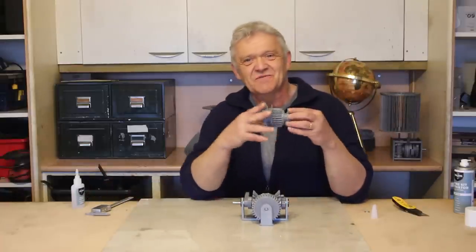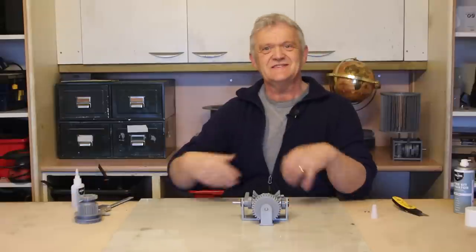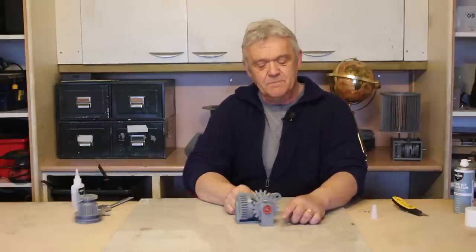The ratchets are a little bit delicate, so if I were to redesign this I'd probably use something like a one-way clutch bearing — we used that in a freewheel generator we made. But the ratchets are easy to see and easy to understand. This creates a mechanism where that up-and-down motion translates into only a circular motion, making it brilliant for wave power or any application where you've got linear up-and-down motion that you want to translate into a rotating motion, since that we can put straight onto a generator.